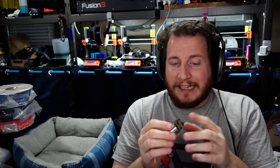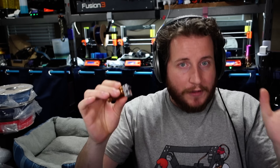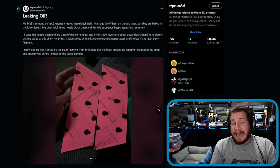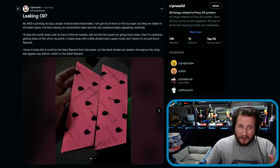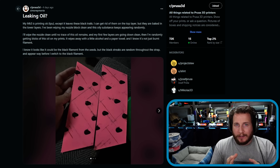This official one had that happen at one point or another. This official one has been upgraded — it's sporting a titanium heat break, copper block, and Nozzle X, which for the time was the best combination possible, like a $140 hot end. If you don't tighten them to each other — do not tighten the nozzle to the block, you want to tighten it to the heat break. In the E3D instructions, they tell you to tighten the nozzle to the block, then take two turns out of it, then screw in your heat break, get everything to a nice hot like 290°, and then torque the nozzle down. That has worked for us for years without any problems.